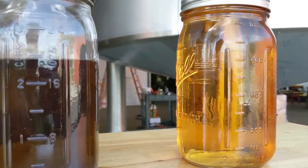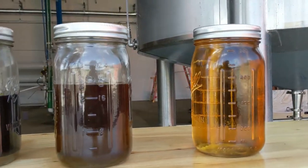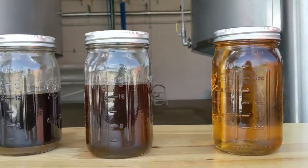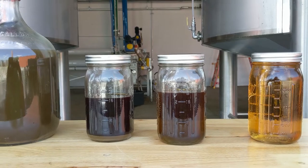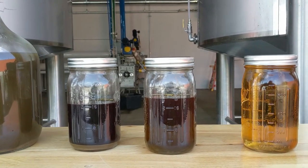This is about 97-98% ethanol, 2-3% cannabinoids. From there we go into our ethanol recovery skid and then decarboxylation to a crude. This is a five-hour process to go from biomass to a fully de-waxed, decarbed, winterized crude oil.